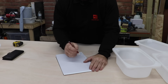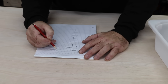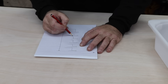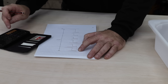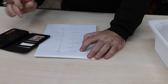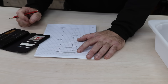With all the dimensions in hand I can now work out what the final size of the unit is going to be and therefore what size I need to cut my 12mm ply to. So from there to there is 600 plus gaps. For this project I bought a full 8x4 sheet of 12mm ply because I have the capacity to get it home, but I think it's a good idea to still buy a full sheet of ply and get the DIY shop to cut it down on their panel saw, just to be able to get it into the car. It's the cheapest way of buying plywood and it means you've got plenty left over for the next project.